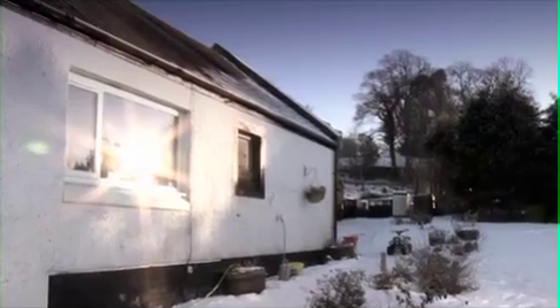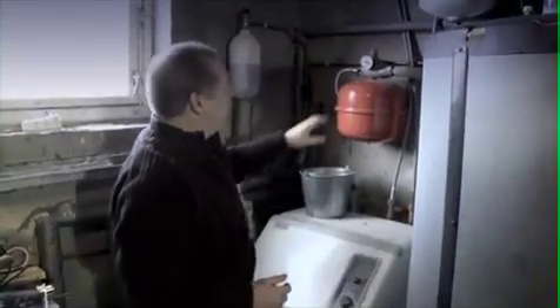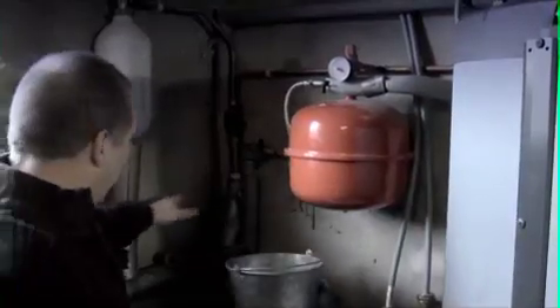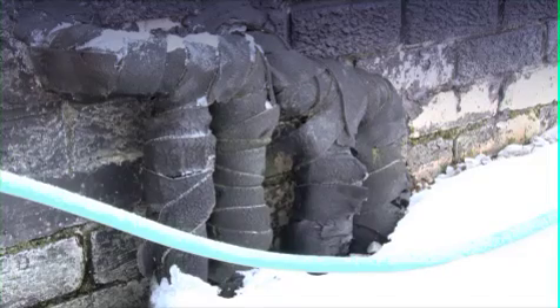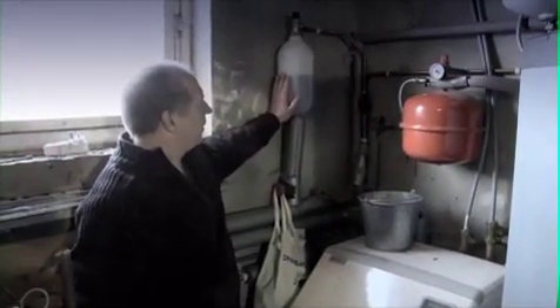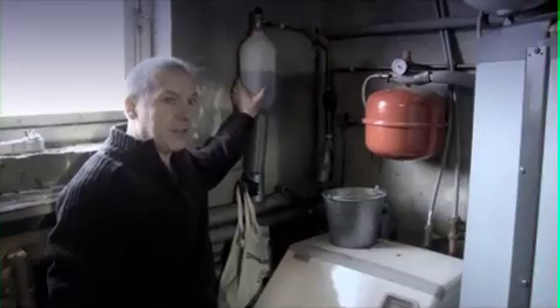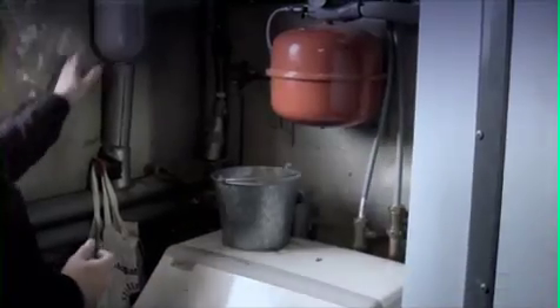This is basically the system. It's very straightforward with a large water tank. The hot water is gathered in there and it's fed from an expansion tank. These lead out to four pipes that go outside underneath the ground — that's two loops of 300 metres. It's sending this glycol, which you would recognise in your car as antifreeze — it's a kind of blue liquid — and it comes back and brings heat into the hot water.